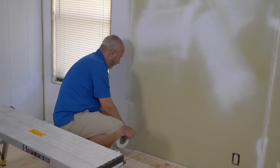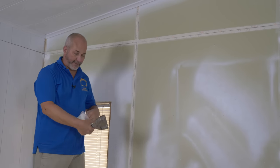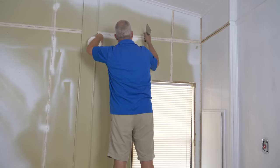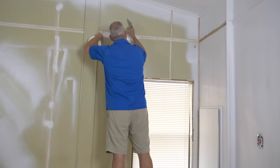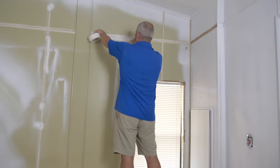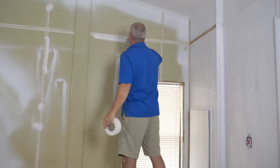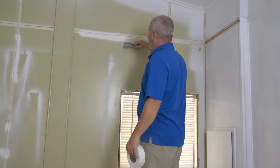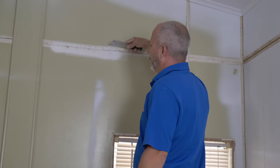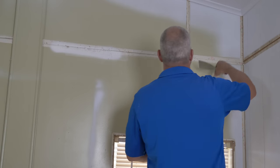The oil primer takes about 5 to 15 minutes to set up, depending on the ambient air temperature and humidity. Basically, you want to go from about a half inch of drywall paper to mesh as an overlay, and keep doing that until you find another half inch of paper again. You'll always have a good bond that way — you won't be disappointed.